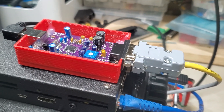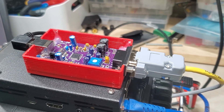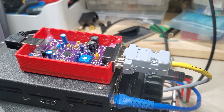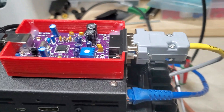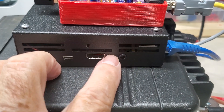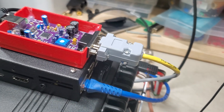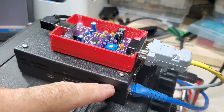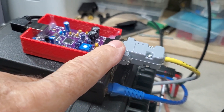I powered the RL20 with what we call a dongle DC-to-DC converter. What it does is take the 13.8 volts from the radio's accessory plug and converts it to 5 volts at 3 amps — more than enough for the Raspberry Pi which is underneath. There is no external power cable here; it all comes internally. If I pulled this up you'd see the cable going into the Pi, and underneath the board there's a red cable bringing power from the radio.